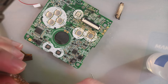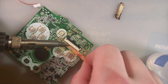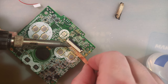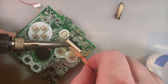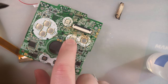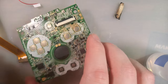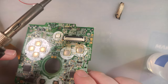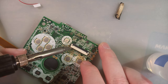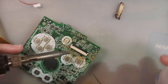The proper way to solder one of these things is with a temperature controlled oven. But the problem with that is that a lot of these parts are only rated for, you know, like one or two reflow cycles. And most of them have already hit that. As in, the parts on the SP itself already, like the buttons, card slot, switches, ports, that sort of stuff. So running it through the reflow oven is not the best idea. That does not look very soldered down. But maybe it is, and maybe I'm just a hater.